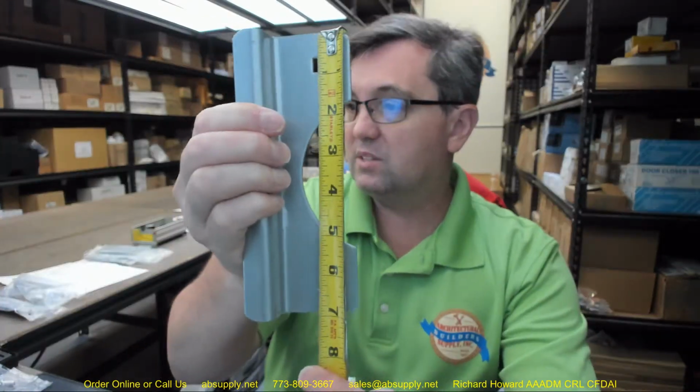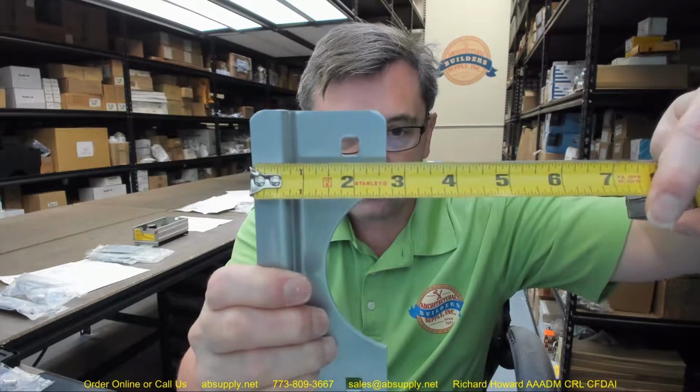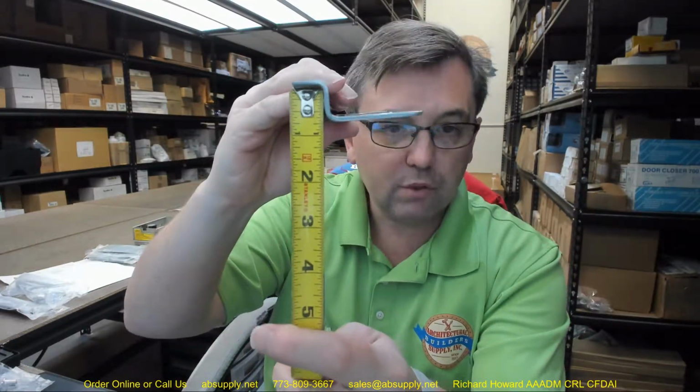Now, the link to the product catalog, we're going to touch on that again in a moment. The link below this video to the template will give us all of the dimensional properties of the item. That 7 in the part number is certainly going to mean that 7-inch overall height. The overall width of the unit, they have it at 2 5/8. I'd say that would be accurate. They show that that offset is 3/4 inch, and I would say that that would be accurate.